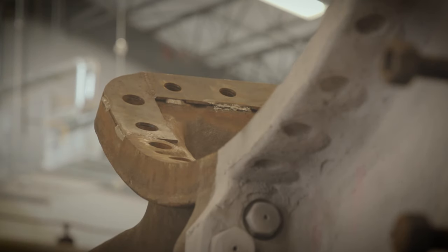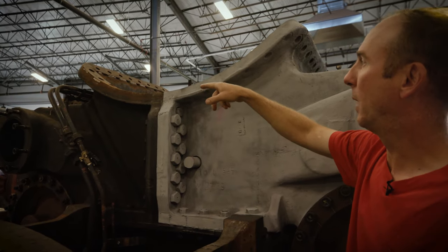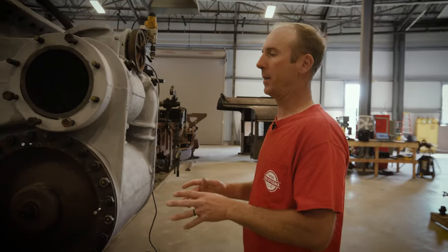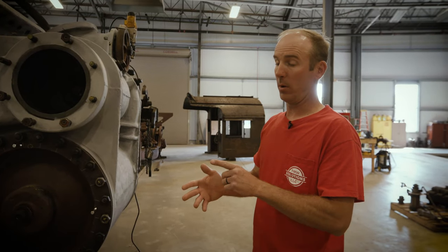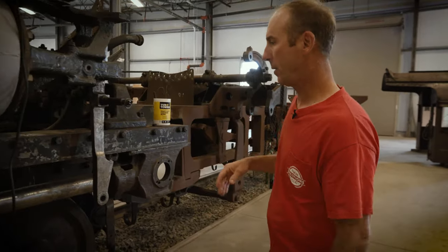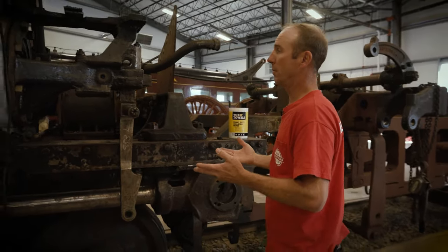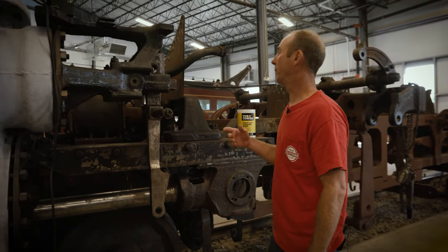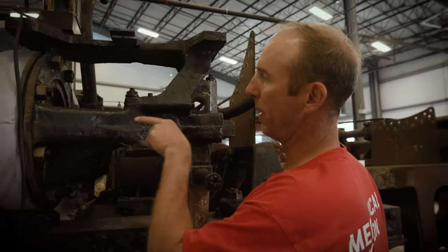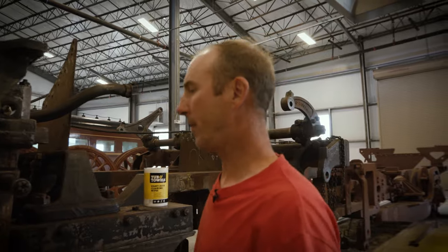We do have a couple of issues here with the saddle. You can see where someone has welded on some shims, from where that was either corroded or broken. Some of the stuff that had been done that was either reworked or not even touched at all, we really have to go through thoroughly. As we walk around the steam chest to the back side, things such as a piece of all-thread that was welded in — we don't know if that was just butted up and welded. The old packing gland studs were on the sides on a horizontal plane, so stuff like that we need to look at.